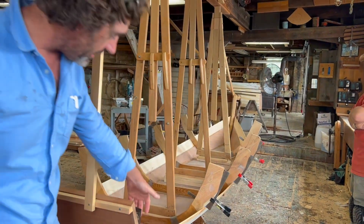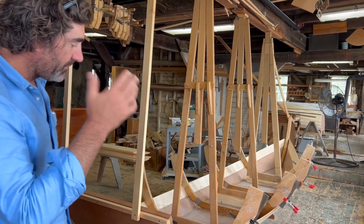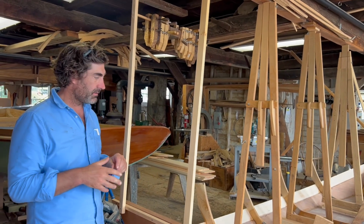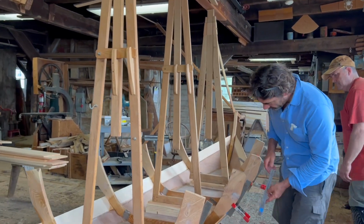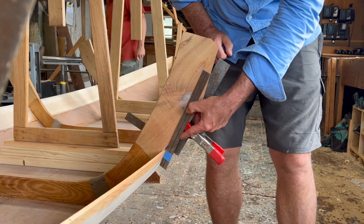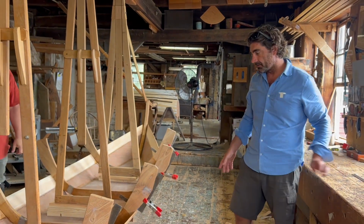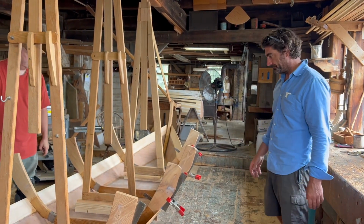So the next plank, the shear plank, and this is fairly typical for these boats, we're going to draw these lines, and then we're going to trim off a flat onto the frame, dub it basically, for the next plank, and then that will go on. And then for the shear plank, we have to dub it again. And the shear plank, typically, is cut up with the lap. So you essentially take this straight edge, like this guy, and you lay it flat across your lap like so, and you carry that line straight up, and then you trim that off. And the beauty of up with the lap is that you don't have to put a corresponding bevel on the lower edge of your next plank. So if everything goes up with the lap, that shear plank essentially has no bevels and just goes right on there.